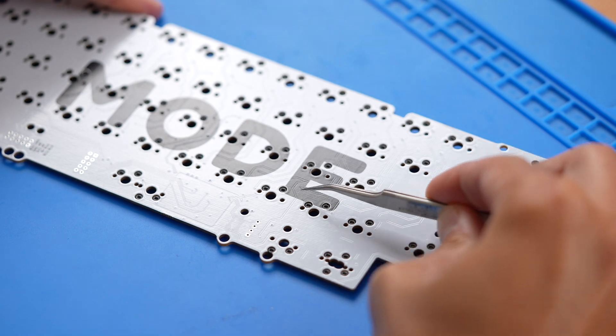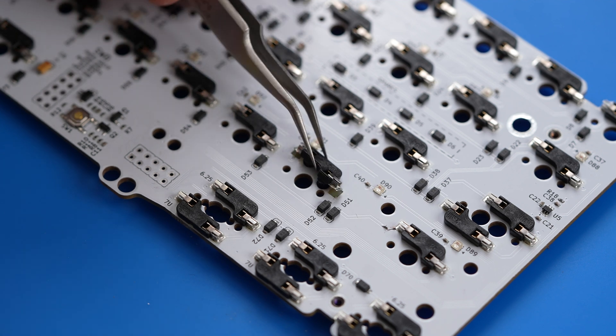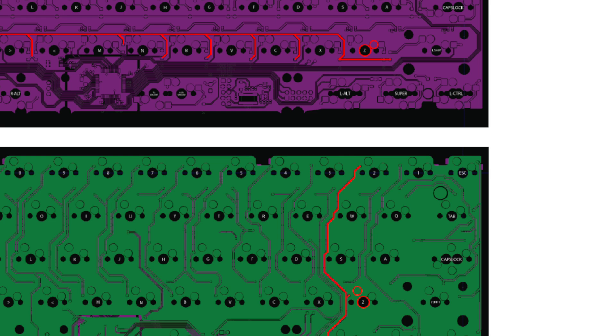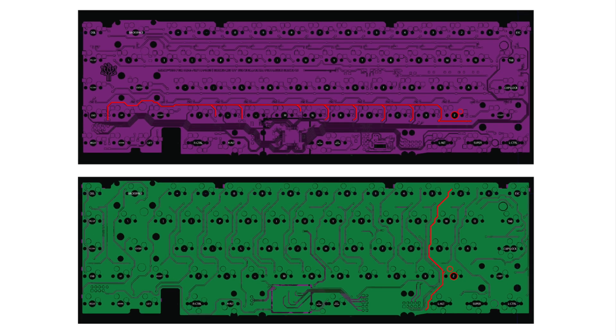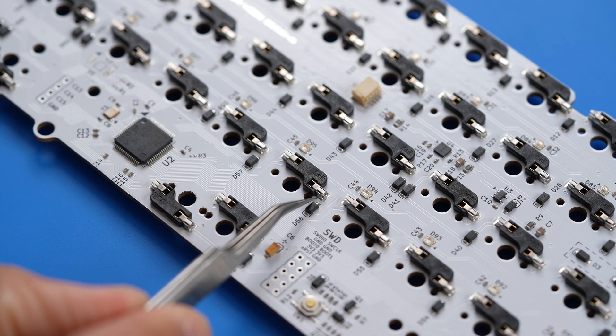Next, we need to restore the electrical connection of the hotswap socket to the adjacent row and/or column. We need to determine what the closest adjacent row and column pins are from the surrounding switches, and identify which of the hotswap socket pads goes to the column and which one goes to a row. Mode has shared PCB diagrams of the bare PCB substrates linked in the description below for troubleshooting purposes. If you need help figuring out where to solder your jumper wires, you can always ask in our build help channel in the Mode Discord. For this example, the Z key socket has popped off. When testing the PCB in VIA, the Z key was unresponsive. Inspecting the row and column matrix, the left-hand socket is connected to the column and the right-hand socket is connected to the row. On Mode PCBs, the diode is typically between the row pin and the switch — the row side has a diode on it and the column side does not.